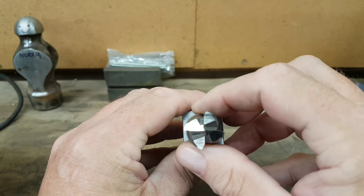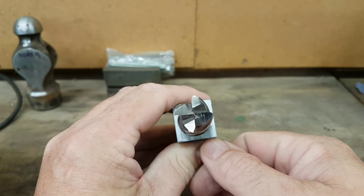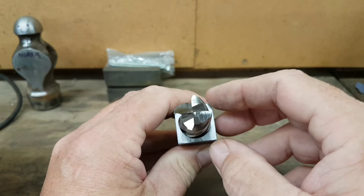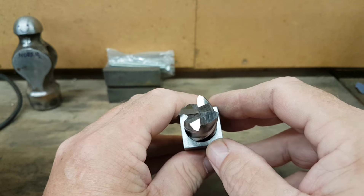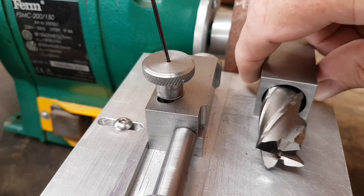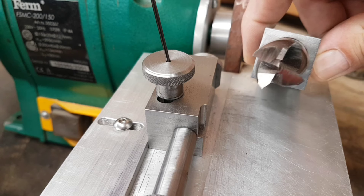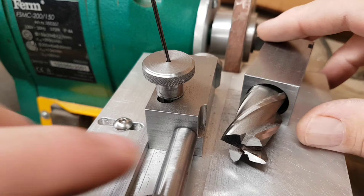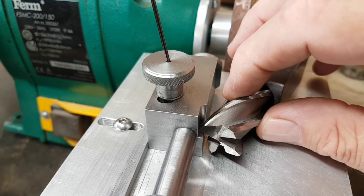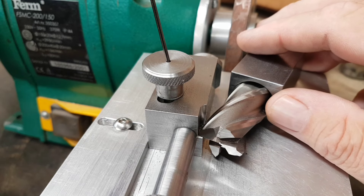You can't have it set like that — it's got to be set so that the faces across here are parallel to the ones across there, and obviously these ones here will be parallel down there, because you need to rotate this through all axes to sharpen it. So what I've done is I've created a shelf. If I tip this up you can see that the faces are not parallel to each other. But if I drop it back down you can see the shelf there, and if I push that to it and rotate it round, you will now see that that cutting face is actually resting on the shelf.